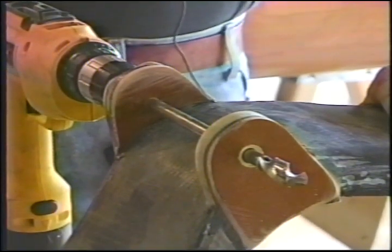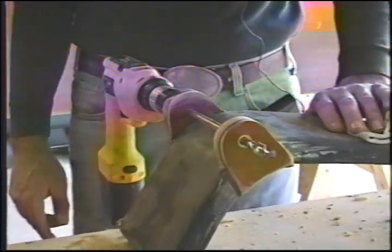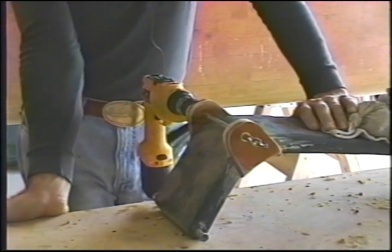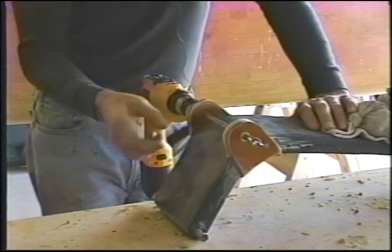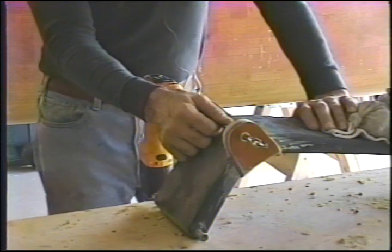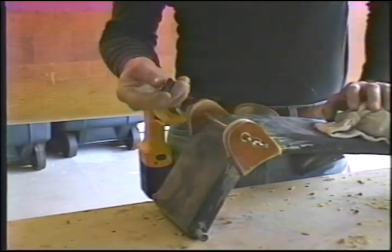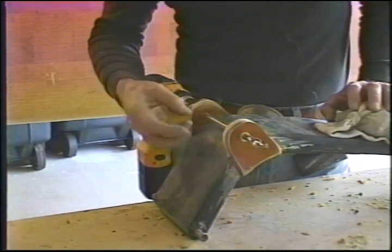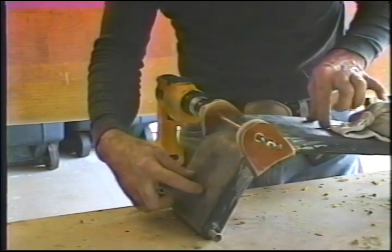We're going to show you some of the things that are really very important to this whole operation, and explain some things that we've done in the past that you shouldn't attempt in the future, especially if you're using our particular tool. This is a mild steel shaft, and it has a bit of a tendency to gall when it's in a relatively soft type of steel, or two steels that have similar hardness. This bushing is the same stock material and ID of a 2.9-inch bushing that will be the last operation you do structurally on your gear leg.